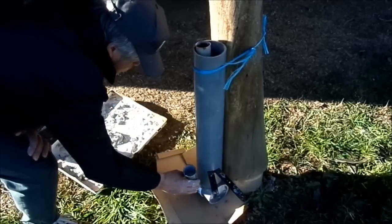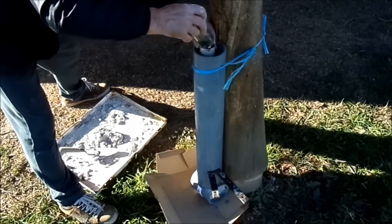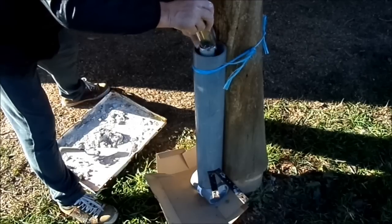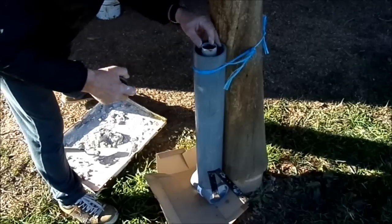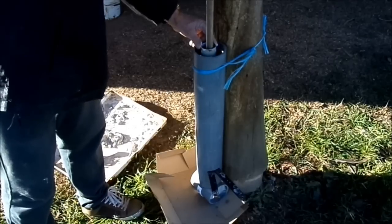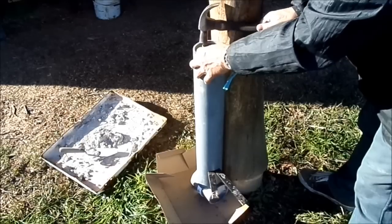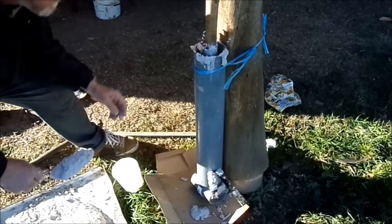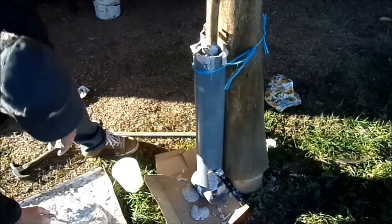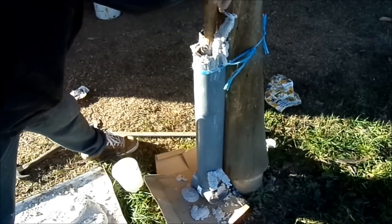The time has come to concrete the vertical assembly. Note that I used a measure to place the mass inside the inner tube, as I don't want that mass to go beyond 10 cm from the top of the tube — the assembly is inverted in order to carry out the concreting operation. The space between the metal tube and the PVC tube will all be filled with cement. I could have chosen to place cement only at the top and bottom, but I decided to fill the entire space for greater safety, despite the inconvenience of the assembly becoming a little heavier.